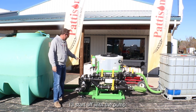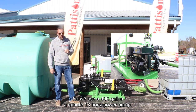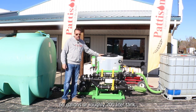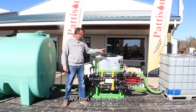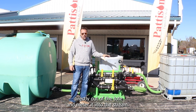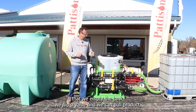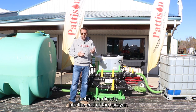We use a 400 gallon-a-minute, 13 horsepower pump with electric start and a rope start as well. The tank we use is a 60-gallon, roughly 200-liter tank. We pull product directly out of the tote and meter it into the stream using a Venturi — by flipping a valve, we can pull product and meter it directly into the sprayer.